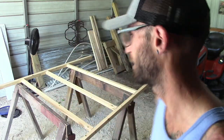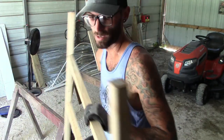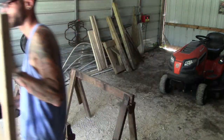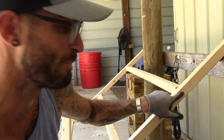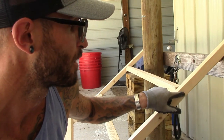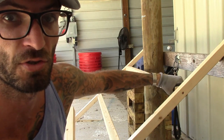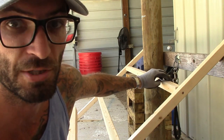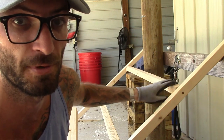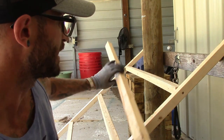Okay guys, that's it. The reason I did it going through the middle — another important part about drilling a pilot hole, especially in this section, is you're less likely to split the wood if you pre-drill a hole before you put that screw in. What's important about doing it this way instead of attaching the piece of wood on top is especially for you guys in colder climates.